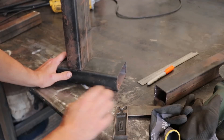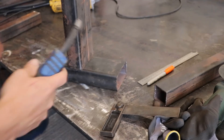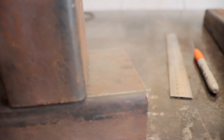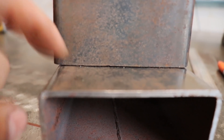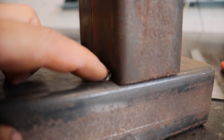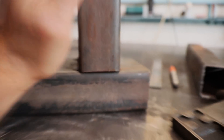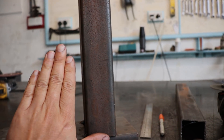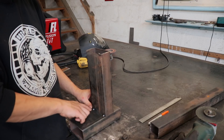Say this was a joint and you wanted it at a perfect right angle. You set it all up with your square — yeah, that's nice, it's all perfect. Buzz a few tacks in. So we've got our tacks on there, nice flush fit out. And then what's happened is it's opened up, because these tacks have shrunk. If you imagine drawing a little line from the top of that tack to the bottom, and then trying to tighten that line — that's what it's trying to do. It's trying to pull this piece over that way because this is shrinking down and pulling that piece over.